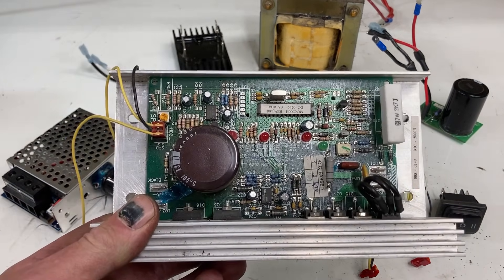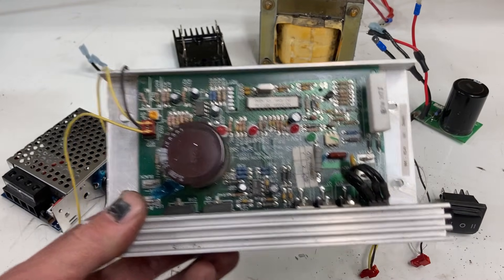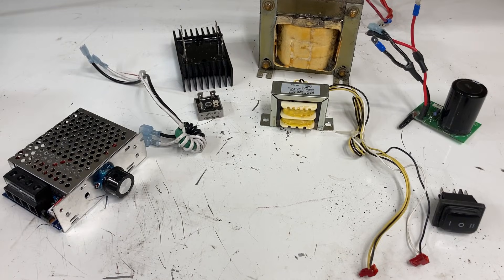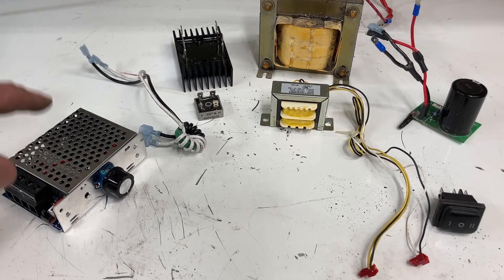This is a pulse width modulator — it's the control circuit out of a treadmill and it works great. It'll power everything but there are a lot of components there to fail, whereas with the SCR voltage controller there are fewer components to fail. The power comes into the SCR voltage controller and we have a knob here called a potentiometer, which is a variable resistor — you turn it to vary the speed. If you hook this up directly to your treadmill motor you're going to have smoke and a mess, because this produces AC current and a treadmill motor runs off DC current.